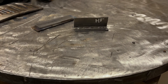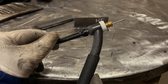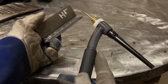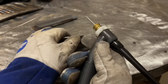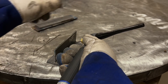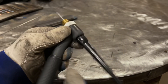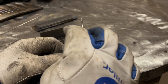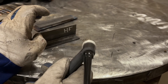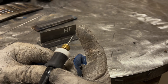Two other things I want to quickly go over. One is, this is not a fixed head TIG torch — I can actually bend it. This comes in handy for inside corner joints and getting better positions, because it moves my hand completely out of this area. When you run a standard non-flex head torch welding at an angle, your whole hand can obscure what you're looking at. Having a flex head or a rotary flex — where it has a nut and knob on it that spins on the shaft — are the way to go for better welds inside corners and hard-to-reach points. You can also change the back cap out to shorten the overall length of the torch, which can help you get into places.